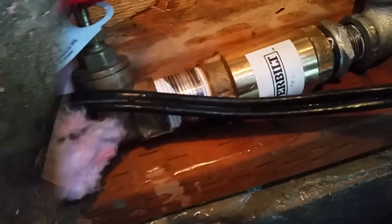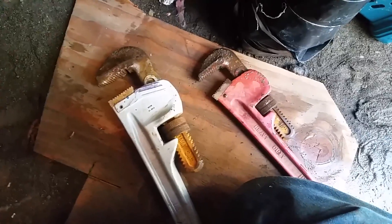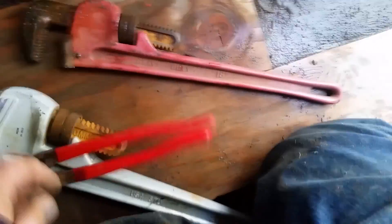I got a leak right there. I'm going to have to tighten this up. Try it again — I was lecturing you on how important it was to tighten your pipe fittings, and I wasn't using the pipe wrench. It feels tight with the channel locks, but it feels loose with this.